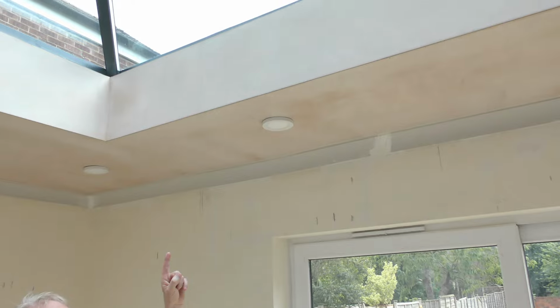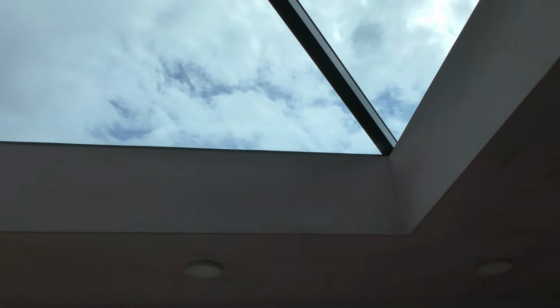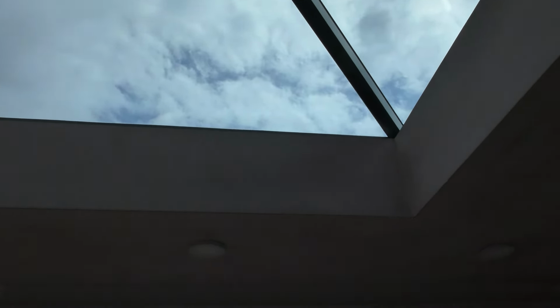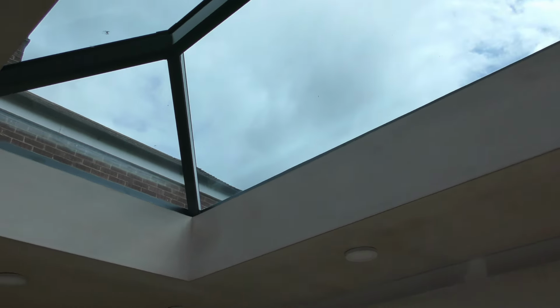Many of us have had some building work done in our houses in the past, and that could have involved having ceilings replastered, walls replastered, extensions put on, for example. And this particular extension here, if the camera can pick it up, they've had this lovely roof lantern fitted, which means they've had to have the ceiling thoroughly replastered. And that was done about a month or two ago, so you can see that the plaster, which was once a very dark pink, has now dried out to a very pale pink with no dark patches on it anymore.